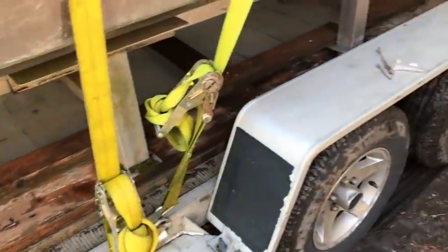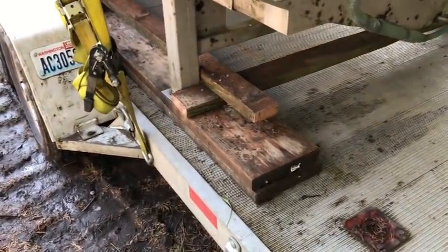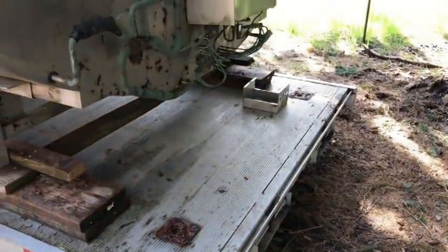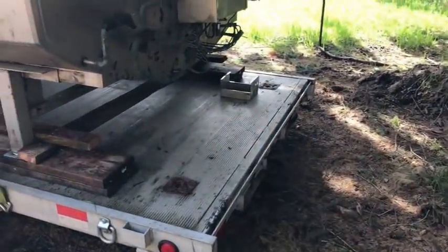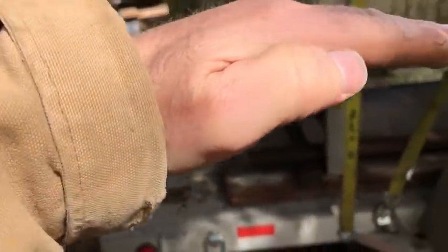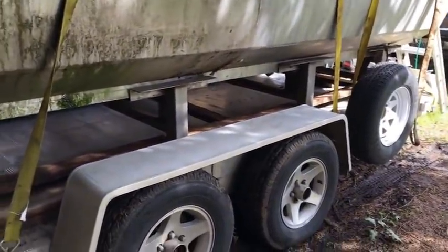The way we got this tank on the trailer — when I got to his farm, he had it on top of some two-by-tens and jacked up so the front end was elevated. I could just back the trailer underneath there, and then he brought his tractor over. We put a six-by-six across the base and he could push the tank the rest of the way onto the trailer. That seemed to work pretty good. When you're pushing on the trailer, the back end wants to come back up, so you have to follow that and push the tank on as it's getting further up onto the trailer.